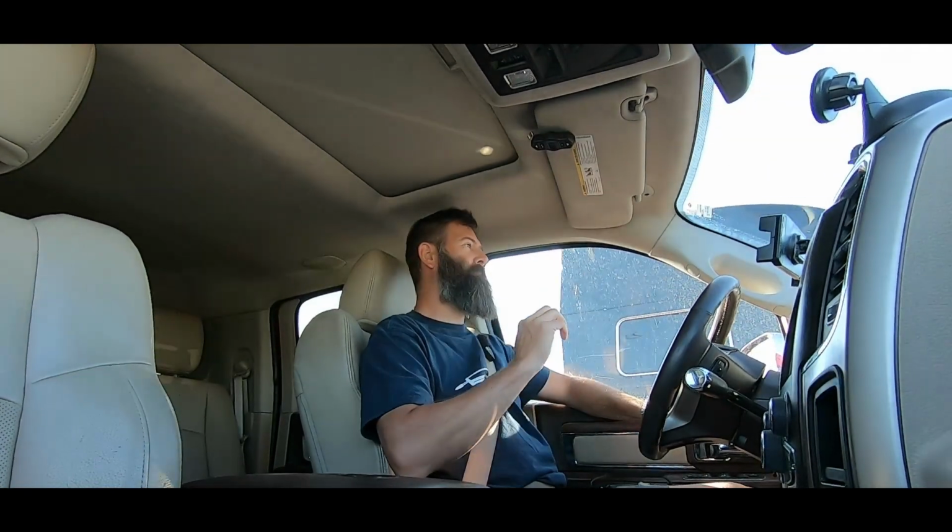The ceiling fans, they are not pre-wired for a ceiling fan. What I mean by that is the box in the ceiling. The box in the ceiling is meant for a light only, not the weight of a ceiling fan. So what I have to do is remove that box and put in the bracing to support a ceiling fan with a light kit. They always add extras.